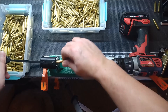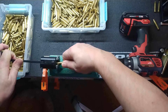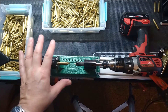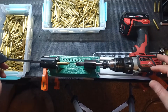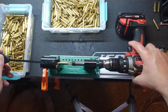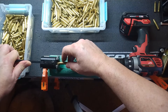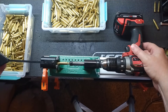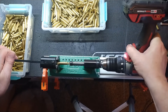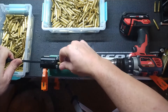The trick with this RCBS trimmer: the spring-loaded jaws work by pushing the handle down, which pushes the jaws forward so you can slide the case in, then you let the handle back and the case is tight. This was driving me crazy at first because I'd put the case in tight and then try to line things up and it wouldn't line up well. The trick is to keep a little pressure on the handle down so the case floats a little — it's not completely tight. Let it float, push the cutter up on it, then release the handle pressure and now the case is tight and lined up. Then just pick up your drill motor and it's done.